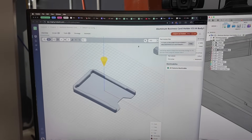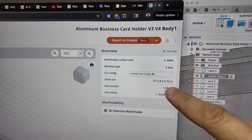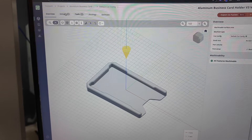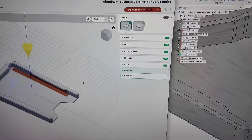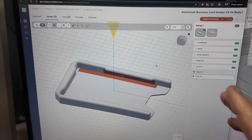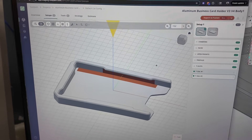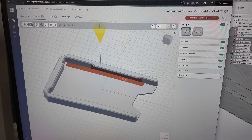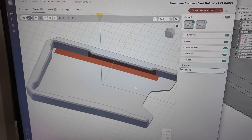This is the result. If we take a look at our overview page we can see we've got a 100% machinability report, which means this whole thing is being machined. If I go to my setups and select T-slots, it'll show me exactly where my T-slots are being machined. Toolpath is now looking at these T-slots in a much more intelligent way — before, it didn't do a great job, and during roughing it would sometimes cut right through those T-slots. Now we're handling it a lot better.